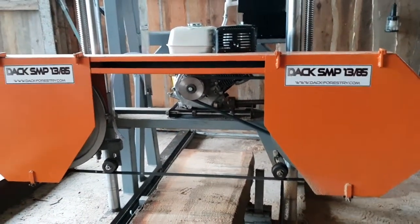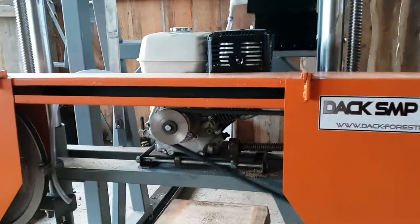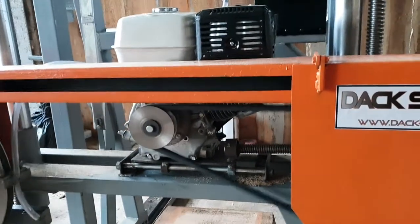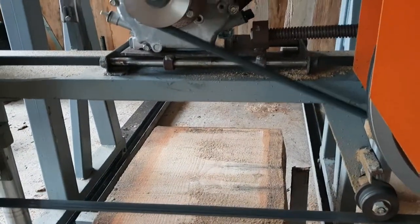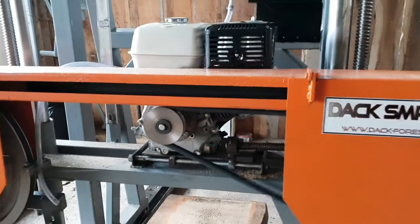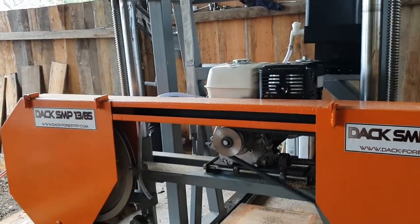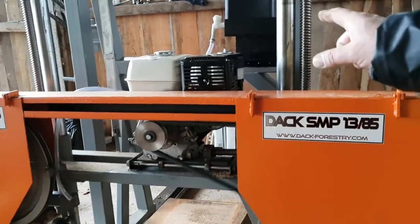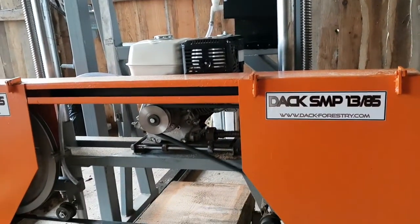At this moment the belt is pretty well tensioned. The speed of tension will depend on what you're cutting. If you have hard wood — oak, for instance — you will have to move the throttle lever onto maximum revs, the rabbit position. Don't forget that. Okay, there's just a few seconds to cut into the log and now we have to stop the machine.